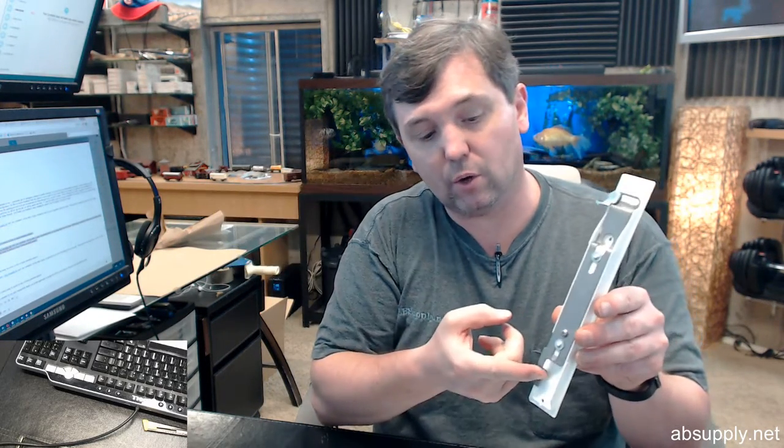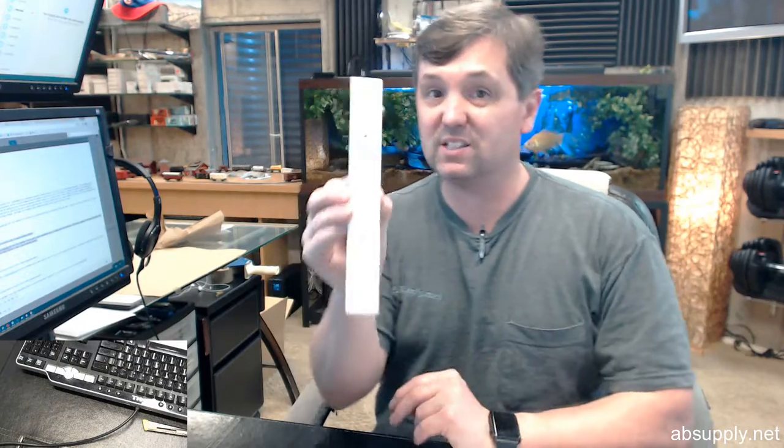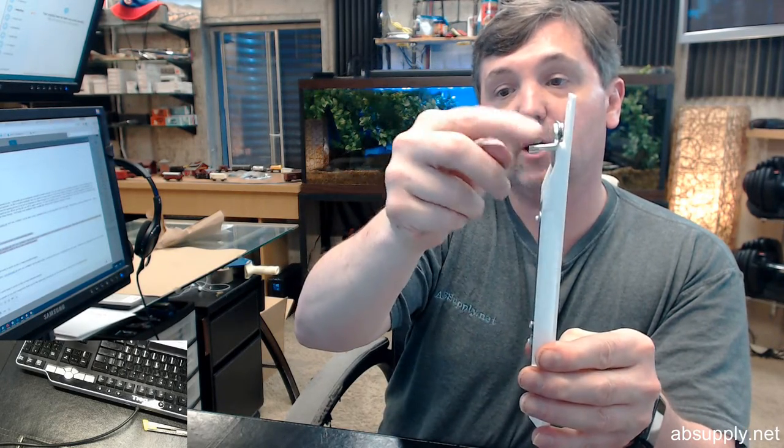In addition to that, it will allow you to unlatch. If there is a key on the exterior, it will also drive that up and down to allow you to unlock the bolt in the edge of the door from the exterior as well. So all this is connected. Now the 41-0397, that's this piece. An interior escutcheon with the knob, with this sliding mechanism, with the tailpiece here.